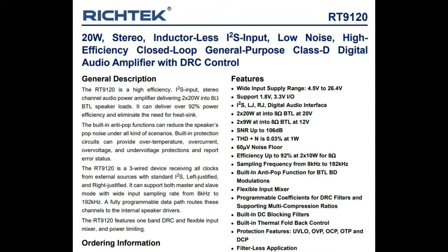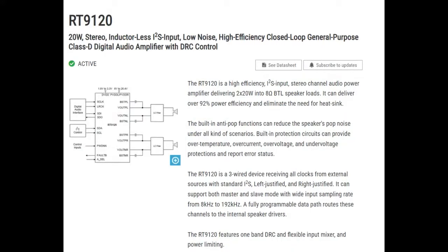This is the wrong screenshot. It's a 30 watt, not 20 watt, because it's the 9120S. It's a 30 watt stereo inductorless I2S input, Class D amplifier with stereo or mono output. Halfway through, I realized that there's the 9120 and the 9120S, and we're actually talking about the 9120S. That's the new version of this chip, which is more powerful. It's pin compatible. So if you have been using the 9120, it's the same, but better